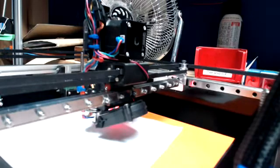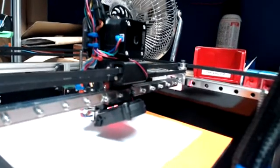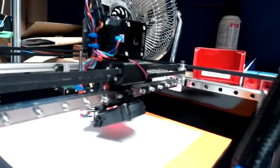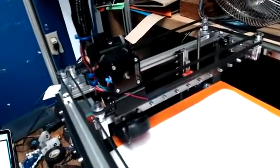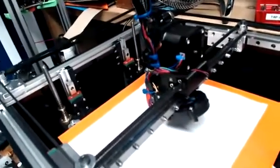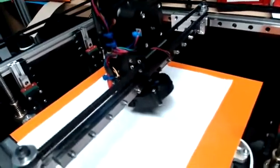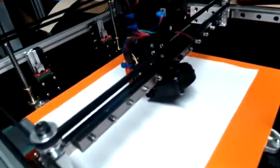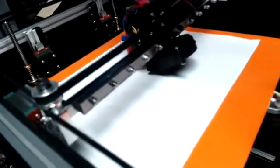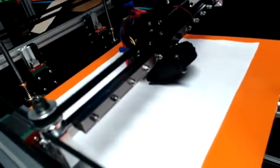The first thing you want to do is measure your Z probe offset and set your Z zero height. I'm going to home X and Y — you should stop at your end stop switches — and then also home Z. If you haven't configured your Z probe yet, I would not just home Z; go ahead and do this manually. But since mine is already set up, I'll let that run.